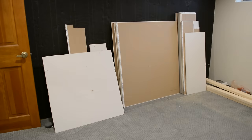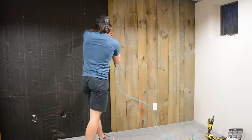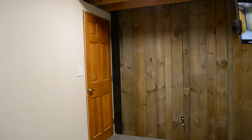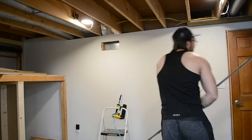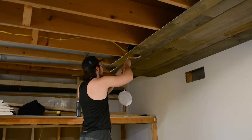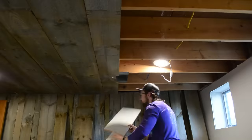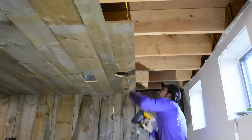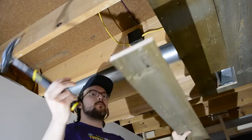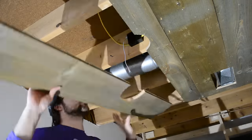It is finally time to put up this wood, and I solved the problem — I am so happy about this. The problem was that the wood looked very gray and bluish in the garage, which didn't go with the vibe in the room. However, I realized the garage light is close to 5000K, which is very blue and was skewing the wood's color. So I used a paint with a yellow undertone as mentioned earlier, and I changed the ceiling lights to the warmest setting of 2700K. When I brought the wood back into the room, it looked a lot nicer — all those yellows and oranges came out with no blues or grays. As for the dirtiness of the boards, I couldn't sand them because it completely got rid of the patina, so I just used a wet rag on areas that really needed it. After going through all the boards again, they weren't all that bad, and the few that were bad I tossed aside.